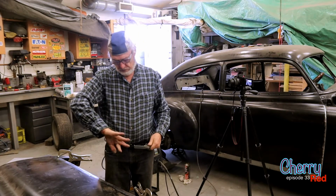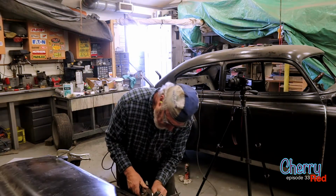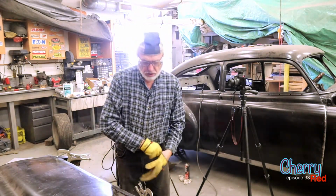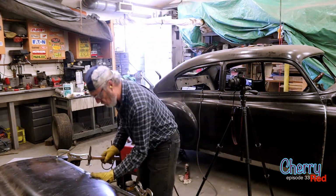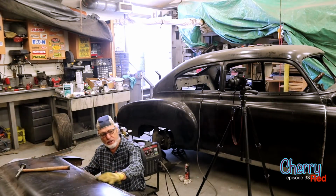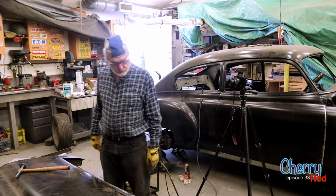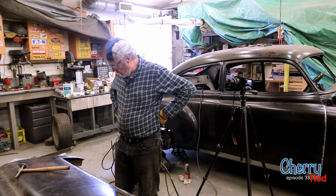So we'll bend it in. Let's do it at the 3/8 inch mark. Okay, so that's our guide for bending this into the V shape. And we'll just go along it with a hammer. Because this door, like I say, has been pretty bashed up, but that's going to be okay, because the new piece is not bashed up. We'll fold it in there and it will give us a good reference for a straight line.